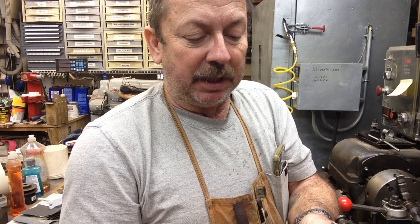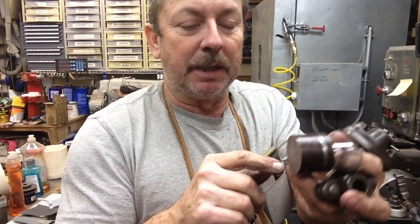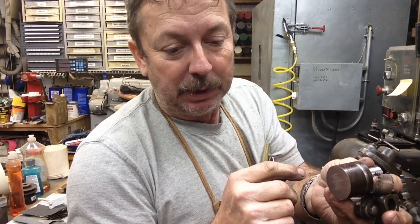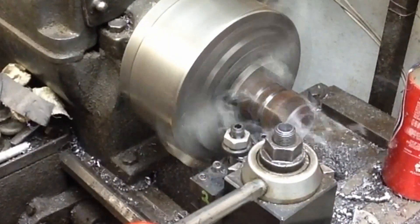What we've done is on this outer diameter, you can see the shank's already turned on this one and we've got a relief cut in the front. That just shows where we're going to separate the two halves. And the part that's unturned there is the shank of this tool holder.